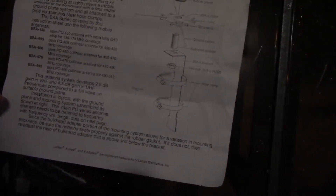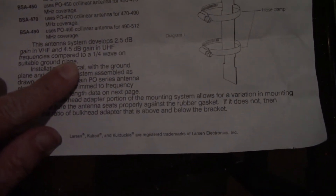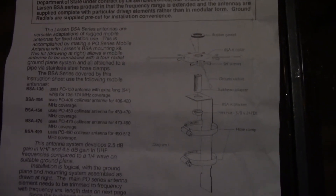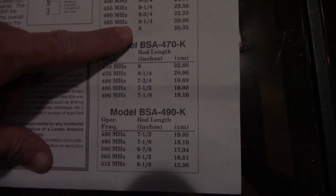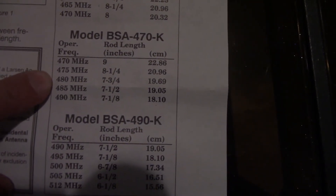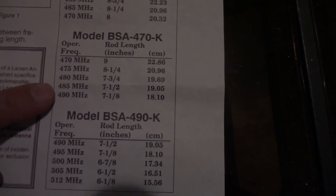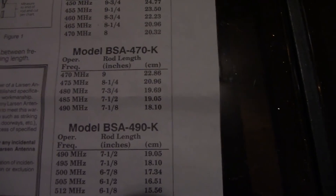A couple things to mention about the antenna: the claim is 4.5 dB gain from UHF, and for a collinear five-eighths design, that's probably accurate. PO mounts — I may not have mentioned that before. Interestingly, since we cut so much to reach eight and a quarter, the 470 model might come cut a little longer, since this one was tuned for 435 MHz and would tune for 460 or 465 out of the box, with shorter ground plane elements.